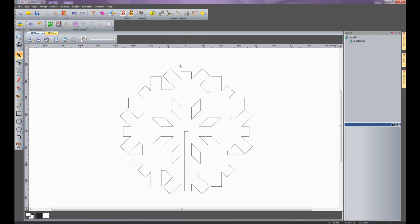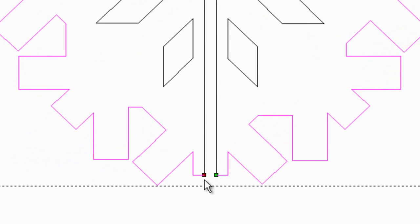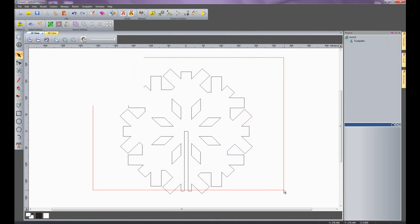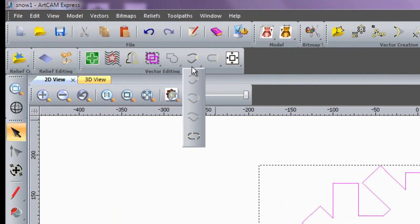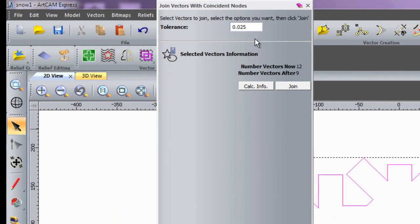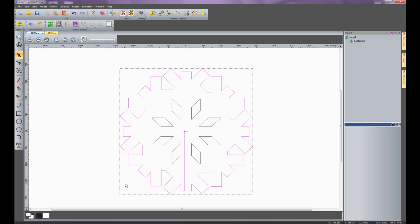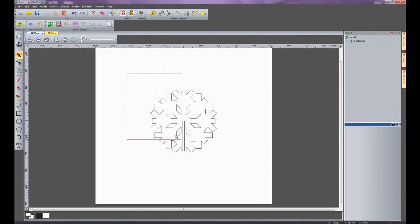There you can see I have a snowflake. If I click on the outside vector, you can see this is an open contour — a green and a red end point specifying it is not closed. I want to close this incorporating the groove. I'll select all of the vectors, hover and come down to join vectors. The number of vectors is 12 and after joining it becomes 9. After clicking join, you can see that is now a closed vector, indicated by a green box.